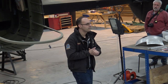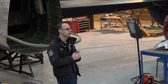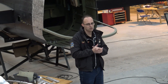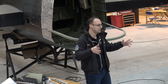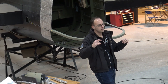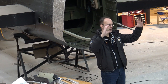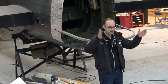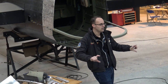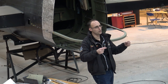It had a boom replaced. We're working with the expectation that we're going to have to replace spars — not because of the life on them. Everyone visualises the main spar of a Lancaster as some big I-beam going from wing tip to wing tip, but it's very different to that. There are four booms: in the centre section, which goes effectively from inboard engine to inboard engine, there's one at the top at the back, one at the top at the front, one at the bottom at the back, and one at the bottom at the front, with a web in between. The wings have the same arrangement and they all bolt together. When the aircraft flies, it stretches the bottom boom and compresses the top, so there's more fatigue on the bottom boom — and it appears the most fatigue is on the bottom boom of the rear spar.